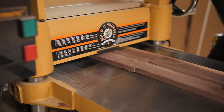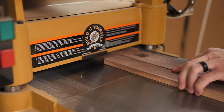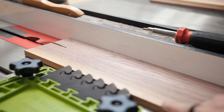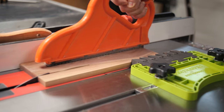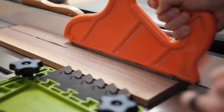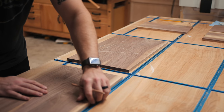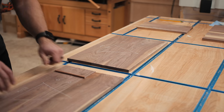Finally, at the planer, I could get the boards totally flat and remove that small ridge left in the middle. Before gluing up the panels, I needed to trim some boards and remove areas I didn't like aesthetically, like the sapwood areas. Once all the boards were cut to size, I arranged them in the orientation I thought looked best and labeled them so I wouldn't get them mixed up during the glue-up.